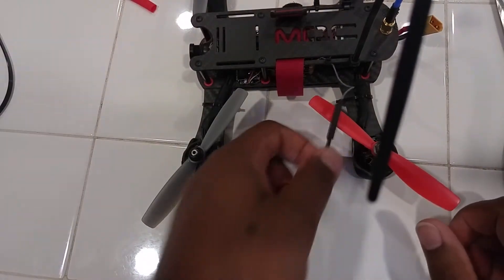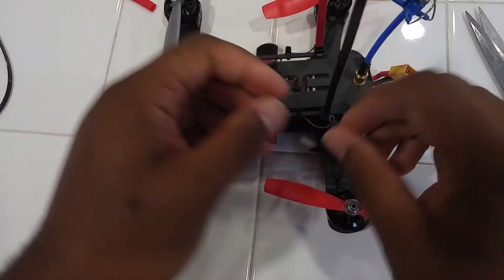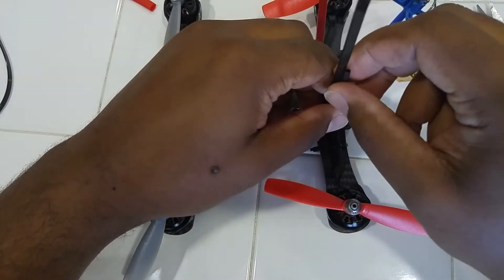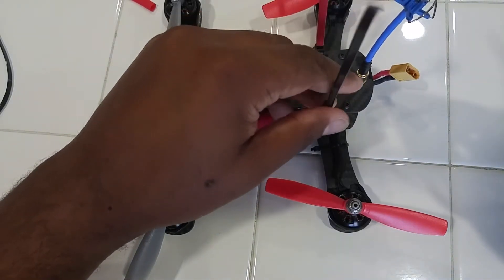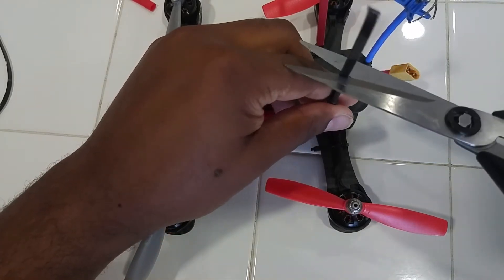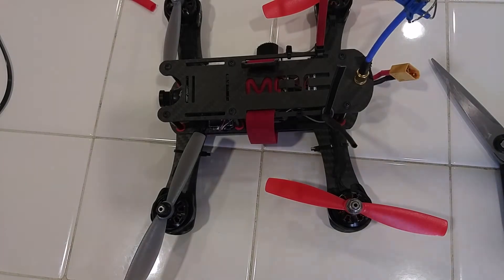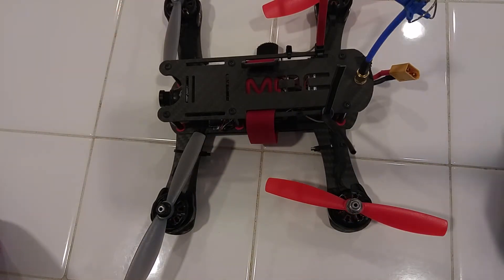Take your antenna and snip off a little extra. Mine had a little extra wire so I just wrap it around like this. You're gonna want to measure where the top is and then go ahead and cut the zip tie to the length that it's going to stay at — so it's the same length as the antenna. I see a lot of people leave the tip of the antenna out past the zip tie, but that's really not necessary since the zip tie doesn't block any signal. It's better to have more protected and heat shrink the entire length of the antenna.